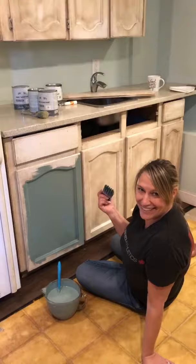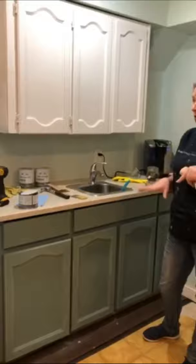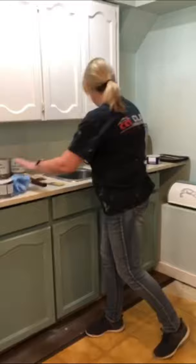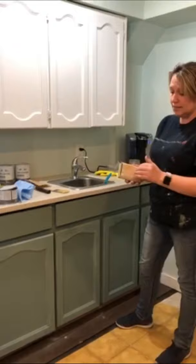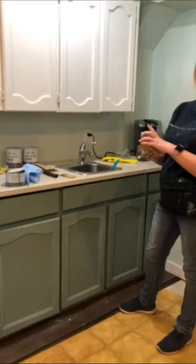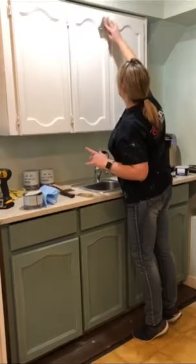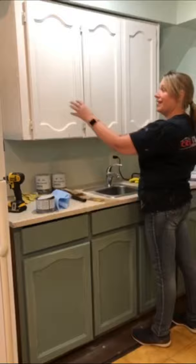So here I am back in my kitchen cabinet. Everything has been given two coats and they're looking fabulous. I wasn't sure if I was going to distress or not, but my new floor is going to be white but a wood look. I live on a farm and have lots of kids, so this seemed like a smart way to go. Often people wonder where and how to distress. I'm just using 150 grit — so it's not super coarse, it's fairly fine — and I've got a sanding block holding my sandpaper. I'm just gently going to go over the edges. On my cabinets I have some beautiful profiles, and I'm going with the grain, removing a little bit of that paint. I'm not going to distress in the center because it won't naturally distress there — it's going to distress where you're grabbing at it. Just adding a little bit of distress.